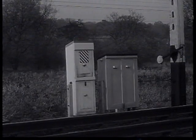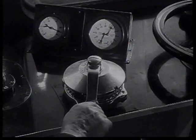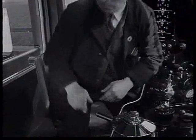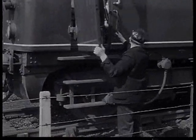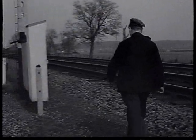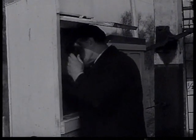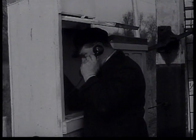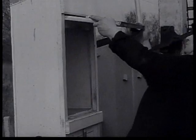But if the signal has a telephone, it is now the driver's duty to carry out Rule 55. In this case he is not leaving charge of the train, and he need only destroy the vacuum and ensure that the compartment door is locked. He should leave the control switch on and the engines running. After contacting the signal box, he returns to the train.